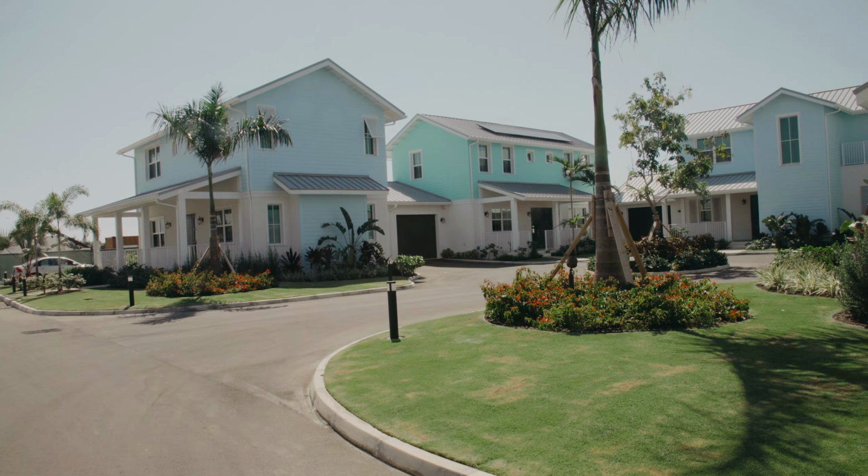And there's just another level, again, of surface prep that's required to remediate that rust, which could be done in aggregate blasting, and then quickly cover the substrate so that it no longer has exposure to the elements and continues to degrade. So there's always an ability to consider an extension of the service life through coating. It's just analyze the condition first, understand what your needs and desire are for the extended service life, and then you can have the ability to make the right coating selection, and then ultimately, the installer.